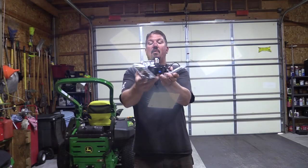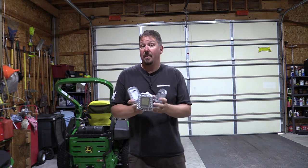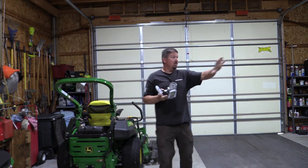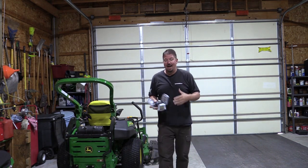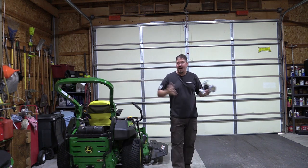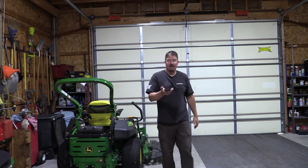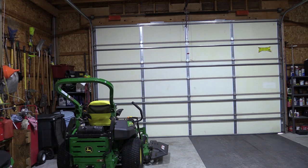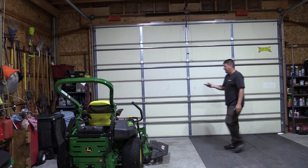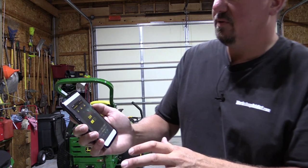I have these lights set up on about a 30-degree angle — they could be moved so the lights shine outward further — but again there are no white walls here, simply just the OSB finish. It's cold storage, so we're not getting a lot of light reflection inside. As far as shadows go, there are some but it's not bad. What we're going to do right now is walk around with our light meter and make a standard sweep, just to give you an idea of what the lux readings look like across the space.